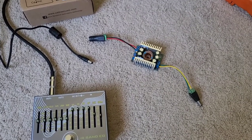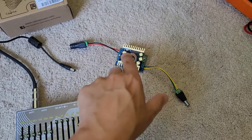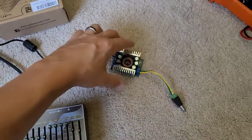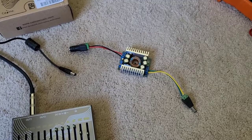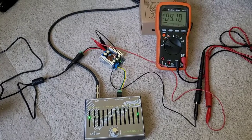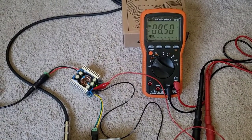What I have here is what's called a buck converter. I have barrel and tip ends on the input and output, and basically what this does is take any incoming voltage and, by adjusting the resistor, you can output any voltage lower than what's coming in — it's a constant voltage regulator. You can get them on Amazon. For any pedal, it simulates a dying battery. Most dying 9-volt batteries are somewhere around 8.5 volts. Here is the incoming voltage from the power supply showing a rock-solid 9.10 DC volts, and here is the output side powering this pedal — a solid 8.5 volts DC.